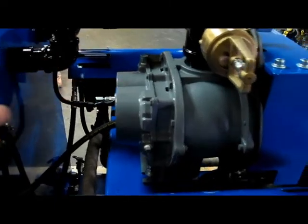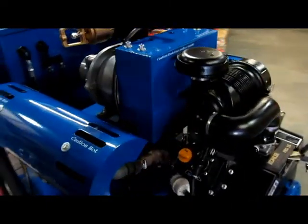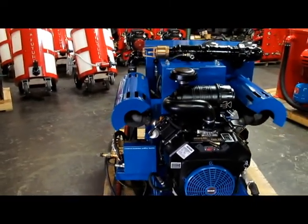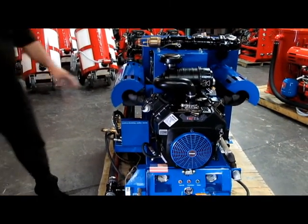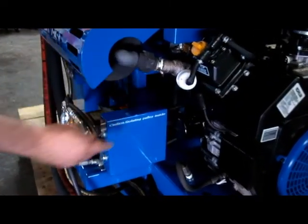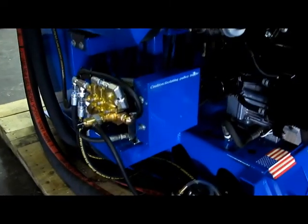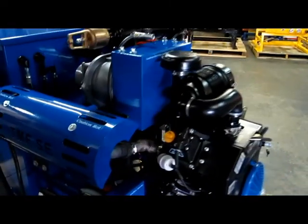Now, as far as the belt change, which on a lot of machines, Mr. Cook, you have to remove certain components out of your way to do, this one is very simple. You can remove the cover by simply removing those 2 nuts, then put the new belt back on. And if you notice, there are no tensioners on this design, Donald. As you tie the pump down, you get correct tension, the way it's set from the factory for this machine.